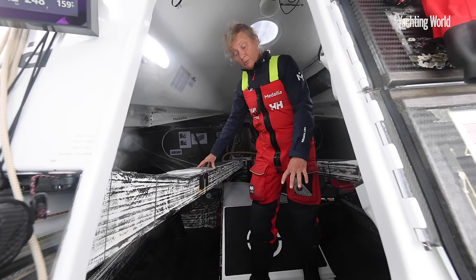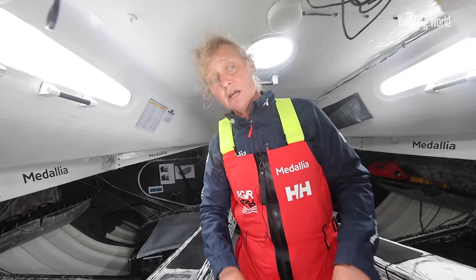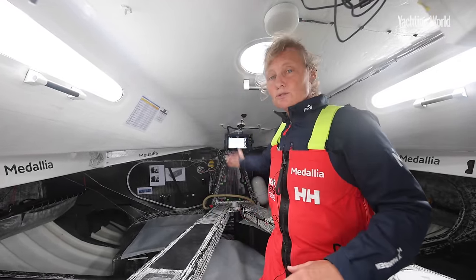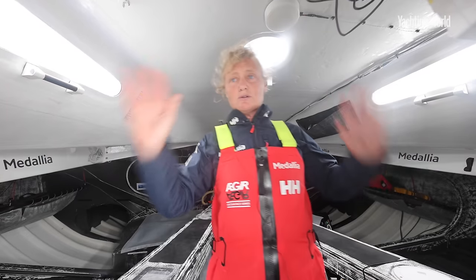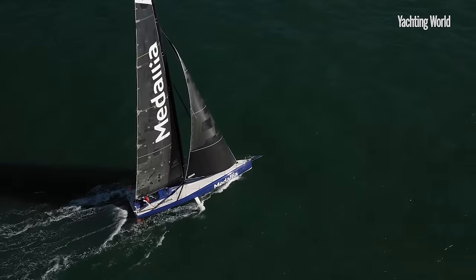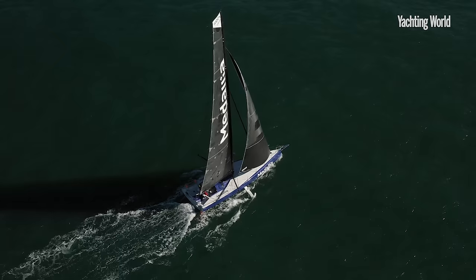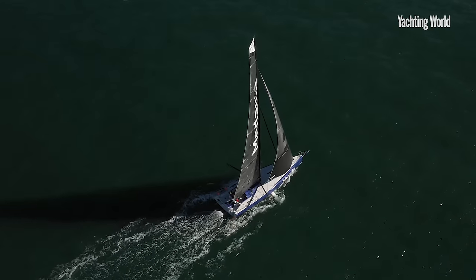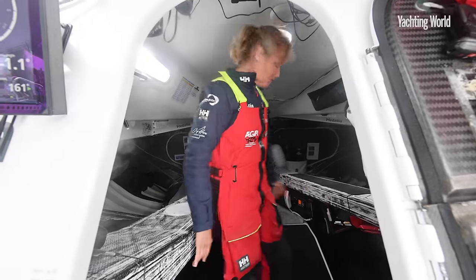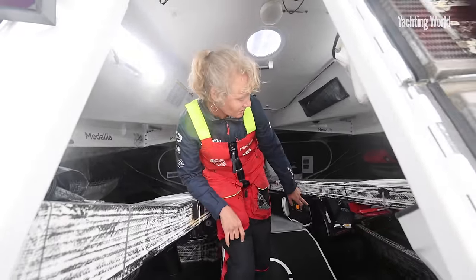So when we got the boat, the batteries were right there. And quite often, when we go really fast and the bow digs in, you end up with about two tons of water on the deck, which rolls down the deck. And then if the boat decelerates, it comes back into the cockpit. In the time that I've had the boat, twice now, it's kind of breached this main hatch and just dumped down. And it seemed crazy to us that the batteries would be in such a vulnerable position. So during the refit, we built a battery box just to the starboard side of the engine down there.